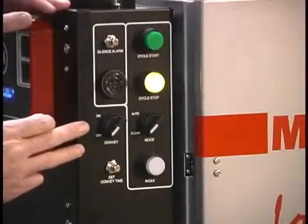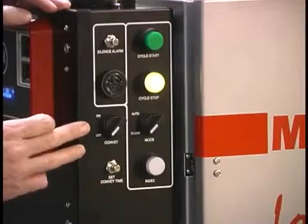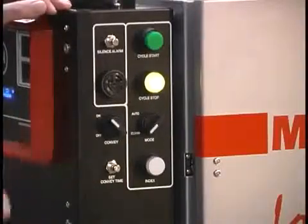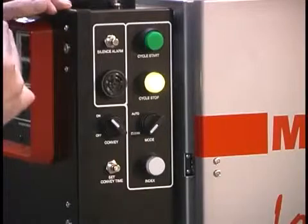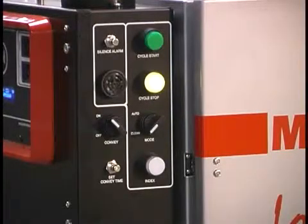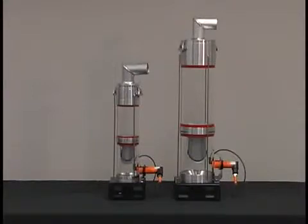Another capability of this vacuum dryer is that this unit has the ability to convey material from the dryer to the process. By turning on this convey mode, it permits the blower to briefly go offline, generate vacuum at the receiver that is mounted on the process machine, and then thus convey dry material to the process machine. This button down here allows you to set convey time. We provide 2 receivers for your loading requirements. We have what we call the ADR1 and the ADR4, and these devices will mount directly on the throat of the machine to convey material.